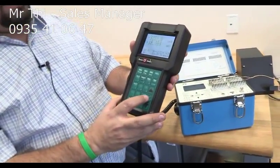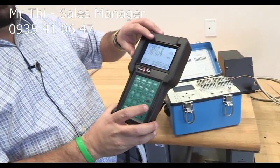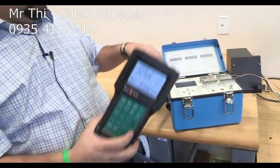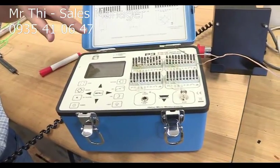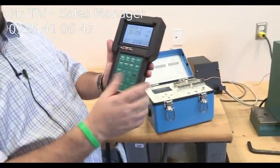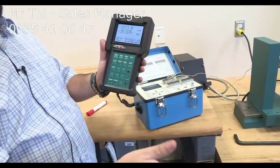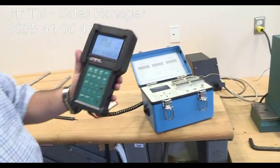And when I want to stop, you hit the circle. So at about 20, you hit the circle. And now it's stopped. You read the torque, 3523. And then the strain, 1790 times 10 to the minus 6. And now we're ready to go to the next step. And again, to go to 30, you have to hit the arrow in exactly the same direction. So if you go forward, you hit the same arrow. So I'm going to the next reading.